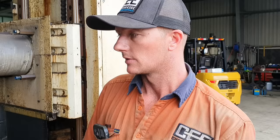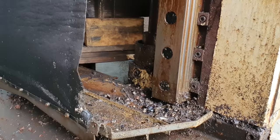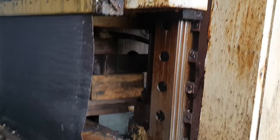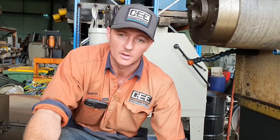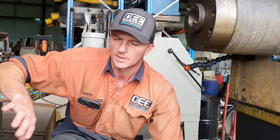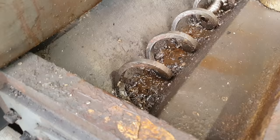So some of the parts are the spindle. The spindle goes right back inside the back of the turret. He wants all the lineal rails, so I remove the rails off this. We're also going to remove the rails off the bed and the ball screw that drives the turret in and out. Once I get all the guards off the table, I'm going to remove those rails. I'm keeping the rotary part of it, the fourth axis. He didn't actually ask for it, but I've got a project in mind for that. And the augers for the swarf screws, we're also going to keep them because a friend of mine may want them for a machine he has.